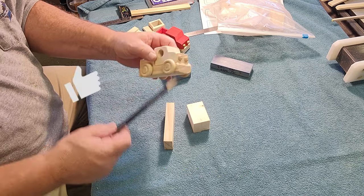You can get these axle pegs from craftparts.com, which I'm going to have the link below. These particular ones, I use this drill bit gauge quite a bit for checking stuff, but these got the 7/32 tenon on them. That's how big they are. But you don't want to drill your hole 7/32 because you want to leave a little room for glue. So I go up to the next size bigger, which is 15/64, and that's the size of drill bit that we're going to have to drill them headlight holes.